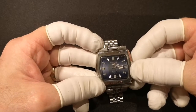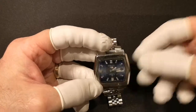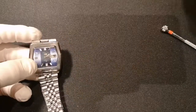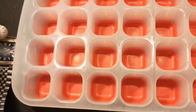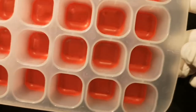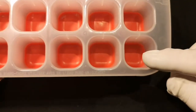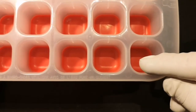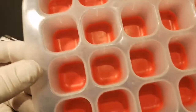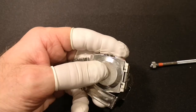The objective is to strip it down to screws and gears, give everything a good clean, reassemble and lubricate it, identify any problems, and then deal with the case. I've got some acrylic glass cleaner and poly watch polish to clean up the crystal, and I'll see what I can do with the case scratches — there's no massive dents, just some minor marks. What's quite useful for organization is an ice cube tray with rubber bottoms, so I can keep everything in sequence — automatic wind mechanism in one section, calendar works in another, train of wheels and so on.